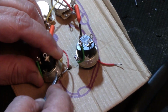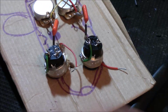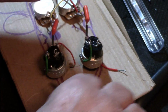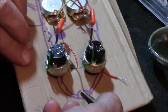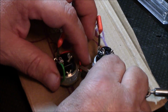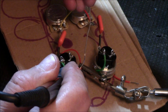And this particular wire is a lighter gauge, so it won't be as hard to hold in place, I hope. Because that is half the battle, holding it in place. And guys, trying to do this with just two hands, give it up. Just give up on that idea. This also works like a heat sink. So I've got to get this thing in there, grab this wire in the right direction, and now push this against the part. Like that. Still not against it. Now it is. Now when I solder this, it'll go in those little indented letters as well as the scratchings I put on it. And it should hold very nicely.